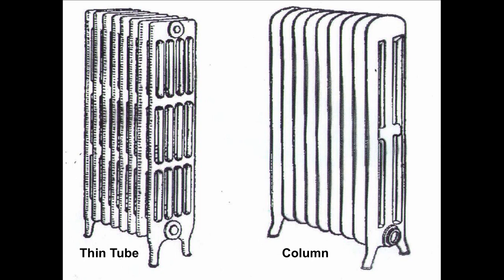Here are your two types of radiator. This is a column radiator, which is a true steam radiator. The inlet for the steam is at the bottom — this is a one-pipe steam radiator. The steam goes in the bottom and the condensate comes out the bottom through the same pipe. The nipples that connect one section to the next — these are the sections like the slices of a loaf of bread — are on the bottom of the radiator. There's no connection between sections on the top.